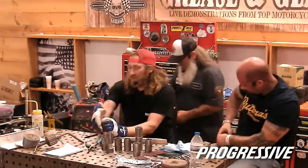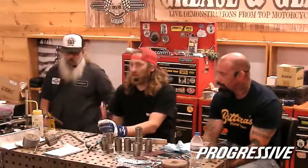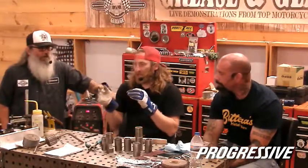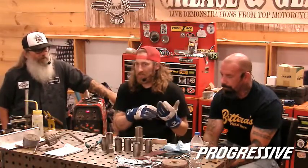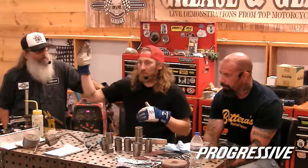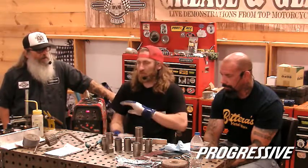If the part only needs 120 amps and you set it at 130 amps, you can almost full throttle it initially, get it welding, and then taper back off and run your weld the rest of the way. So a lot of times you don't want to get crazy with what you're setting your machine. You just want it enough to get the part melting quick enough to start moving.